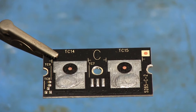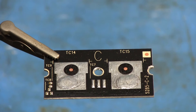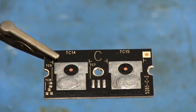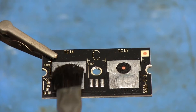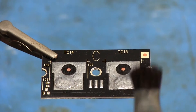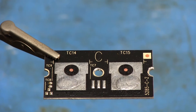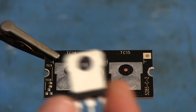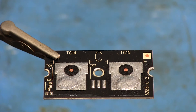We're getting ready to put in the replacement parts. I've put a little bit of solder in the middle of both pads to replace what was lost when we removed the old components. The new parts I'm going to place on top of that, but first I'm putting a little bit of flux on the back of the parts and I've already applied a light coat of flux to the pads themselves with this brush — just a very light coat, it doesn't need to be heavy.